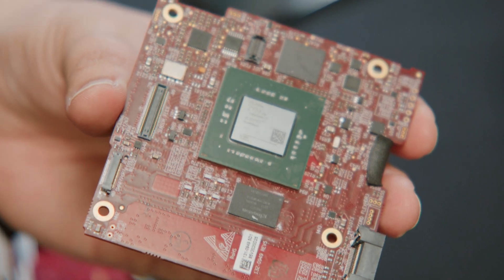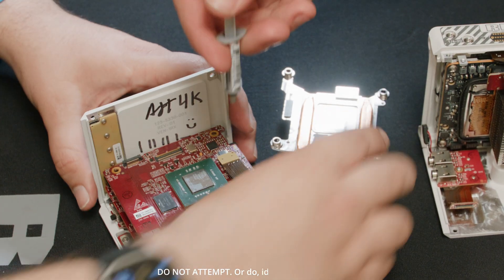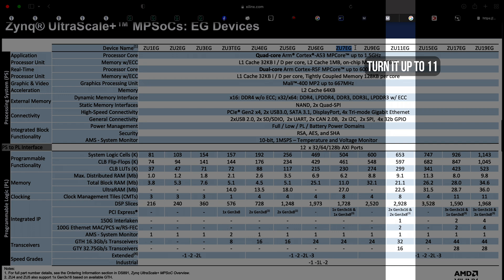Inside the Komodo is a Xilinx FPGA, or Field Programmable Gate Array. You ever wondered why your camera has to reboot when it switches from R3D to ProRes on the Komodo, but didn't have to do that on the DSMC2 cameras? That's because the FPGA is reprogramming itself to be a ProRes camera upon reboot. My thought is just to put a more powerful FPGA inside the Komodo X — same sensor, just more frame rates and more processing power.